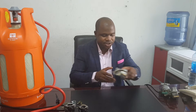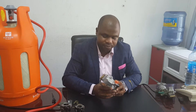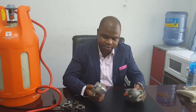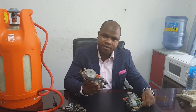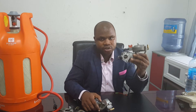We call it a hybrid carburetor. As you can see, it allows you to run your generator on gas or petrol. We have two sizes of it. This is the smaller one and this is the big size. The smaller one goes for generators of 2.5 kVA to 2.6 kVA, and the big one goes for generators of 3.8 kVA to 10 kVA.